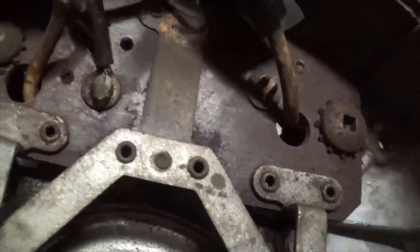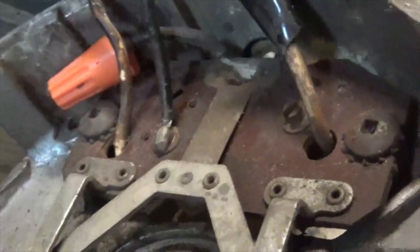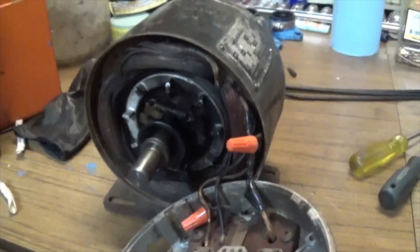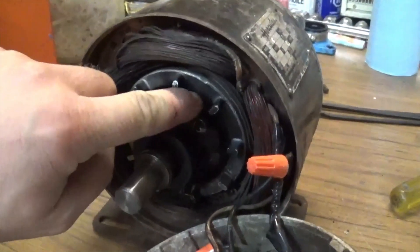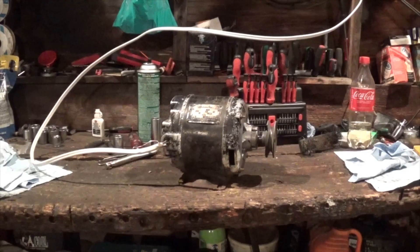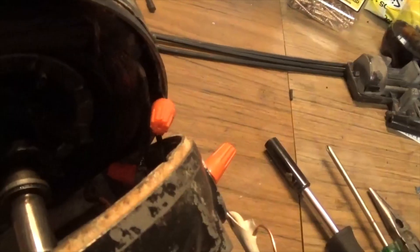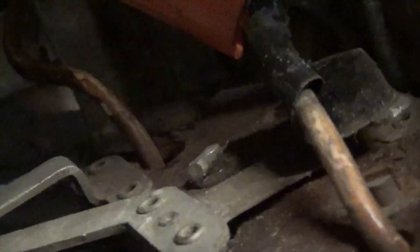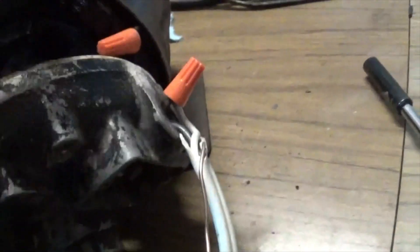Judging from where that spark came out, she looks pretty crispy. I think we're not getting a good connection there anymore - the strands are kind of ripping off. It's still tight on there, so I just aggressively wiggled it around to see if that gives us any kind of connection. Okay, we're getting ultra redneck now - I just yanked that wire right out of its old spot, it wasn't in there very good. We just snaked it back through this way and hooked it straight up here - apparently that's hooked on to the neutral post.